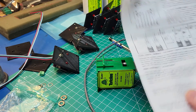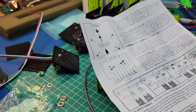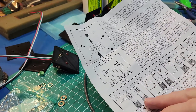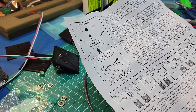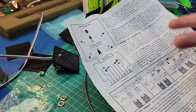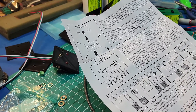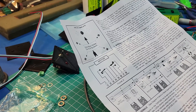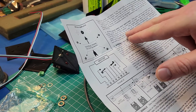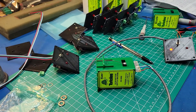In terms of wiring, those familiar with these switches know there are multiple ways you can wire these up. The way they typically recommend is to wire them with a double pole double throw switch and just have it thrown from a single DC line, reversing the polarity of the motor to reverse direction. The electrical engineer in me hates the idea that you just have these things stalled. I know it's fine - they say it's fine, they draw 15 to 16 milliamps each at 12 volts, so it's not that big - but I didn't like the idea of it.